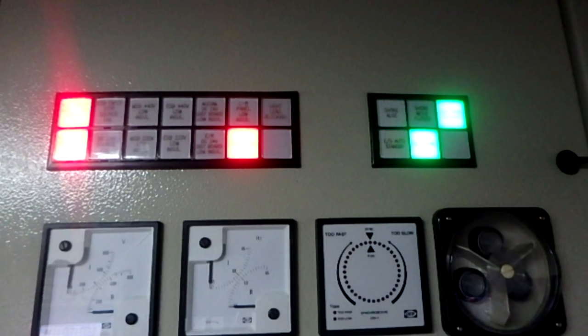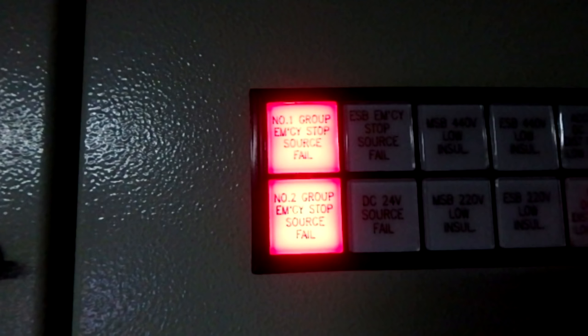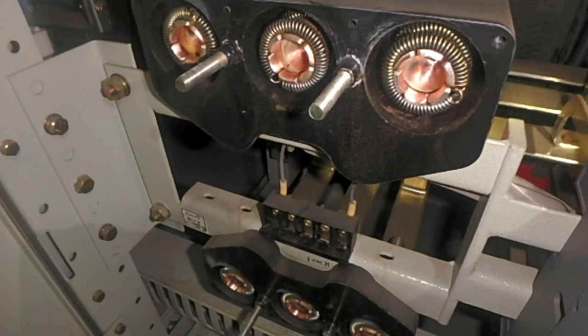Also, we will stop any heating we have in storage tanks and storage lines. We will also stop all purifiers, so we will not have any consumption of steam. And also we will slide open preheating to the main engine.